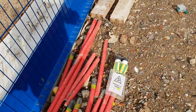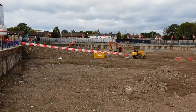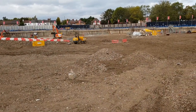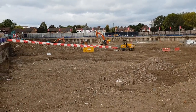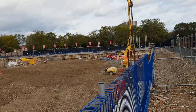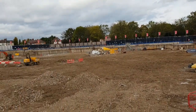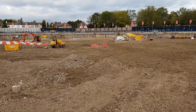So when we start — those cables are just offcuts, no danger. You've got all the grid lines ready, all the setting out done. The very first thing you need to do before starting any works is carry out a level survey of the whole area before we start digging. That's needed for your estimators or QS's — you need to know how much material has to go out and how much crush has to go in.